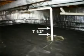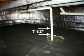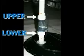more often than necessary. To install the check valve, cut a 7.5-inch piece out of your discharge pipe, and using the PVC cleaner, clean both ends and apply glue. Place the check valve into position and push together. When the glue is set, tighten the upper and lower nuts to finish the installation.